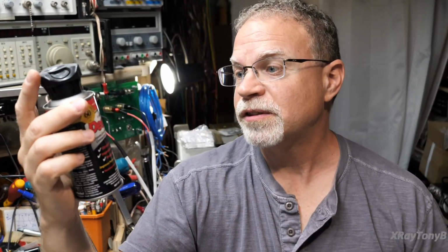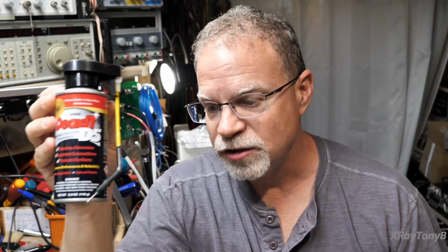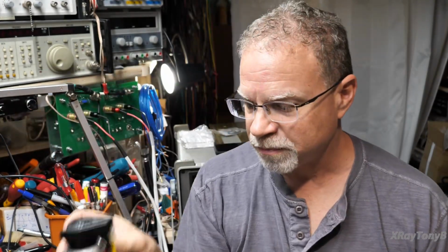And as the story goes, you see time and again on thousands and thousands of videos on the internet that people treat it with this. It has become almost synonymous with cleaning, where people will say, I deoxed the controls. And what they meant was they used this product, in most cases, and they sprayed the potentiometers. What I found, and the reason I'm doing this video, is to warn you: do not use this on potentiometers.